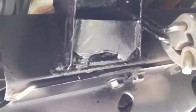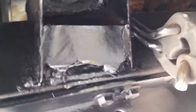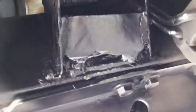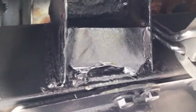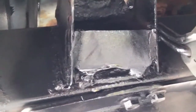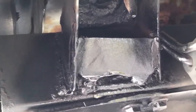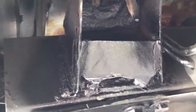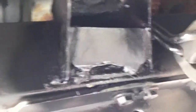I'll put another textured coat on it — the plate is welded in and should hold well enough for what I need. I'm not a fan of leaving pinholes, but in this case it's not structurally critical. If it had been something super important I would have ground those out, preheated with the torch — I'm just using a MAP gas torch which doesn't get it as hot as I'd like — and re-welded to get better flow. Also make sure your nozzle isn't clogged when welding overhead.